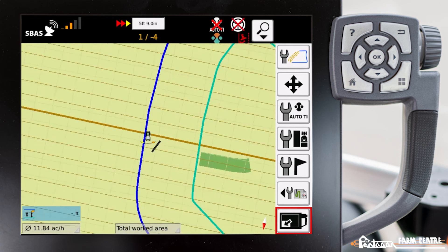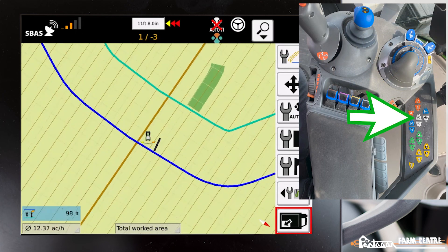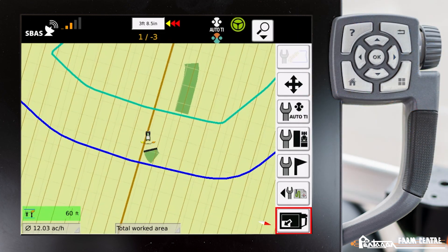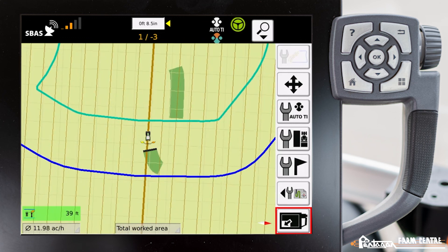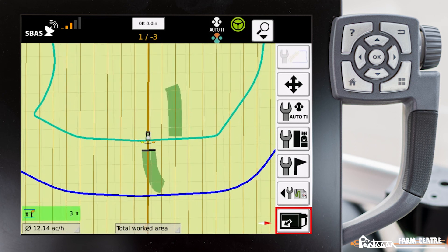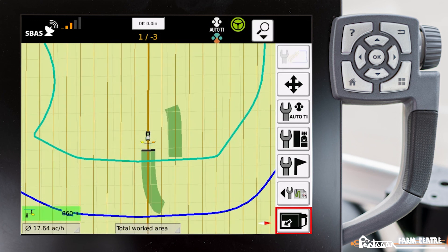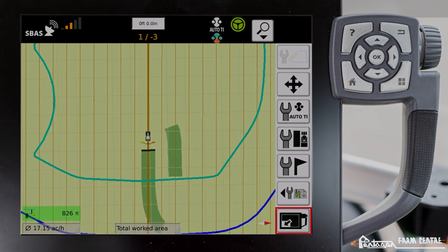Here's the key to teach-in automatic. Right now what we have to do is engage auto steer using the white button on the armrest, or else your teach-in sequence when you enter into the field will not work. Because I have that, my auto steer is now turned on. As we reach the teal line, our go one button will enable — which it just did. It altered my cruise to six miles per hour and turned on my auto steer.